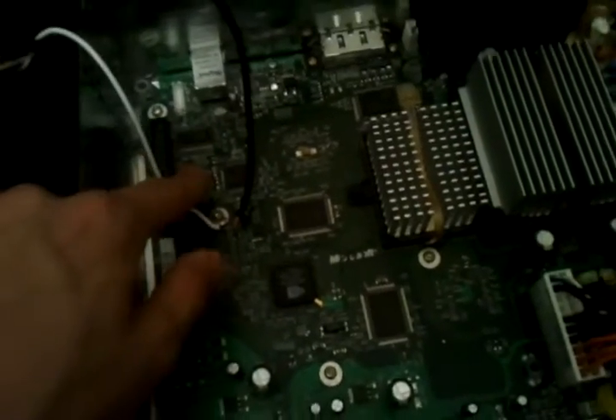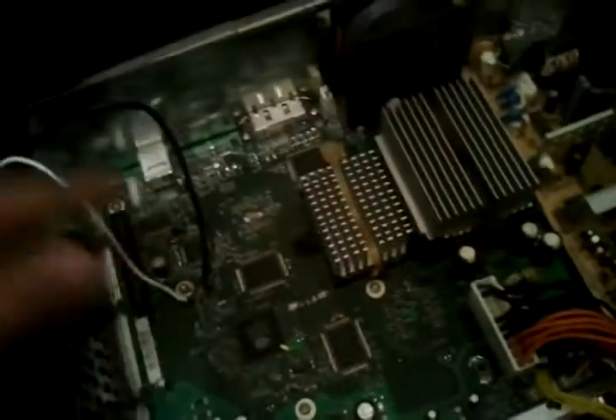That's just a little guide on how you read these EEPROMs and what you should do with serial connections. A quick note about 1.6 Xboxes: these 1 Farad caps are for the RTC — if you don't have them the board will not boot. The older ones you do want to remove them. You can watch Luke Morse's video about that if you're curious. Anyway, I hope you've enjoyed and thank you for watching.